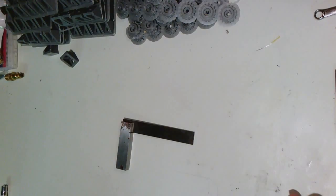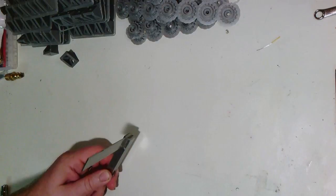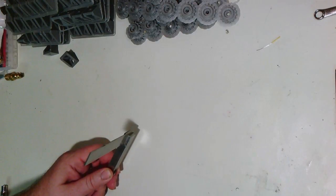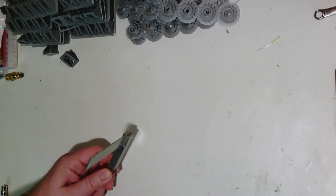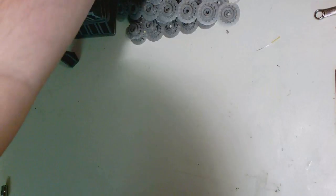Saying all that, your printers will be very, very close to 90 degrees. They're not going to be exactly 90 degrees because of manufacturing defaults. You will be amazed at how something looks 90 and looks flat when you're butted up against it, and it's not exactly flat. And we'll see some of that. For instance, my printer that I built is probably about 2 millimeters, maybe 3 millimeters off at the tallest, at about 19 inches over the course of it. So it doesn't take very much to make that off, but it shows up.